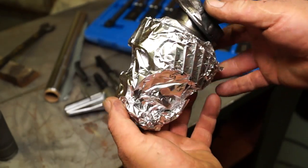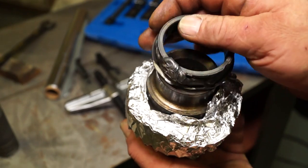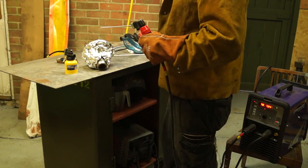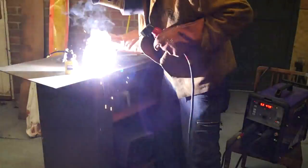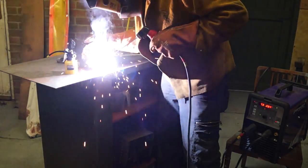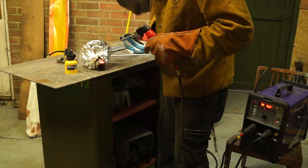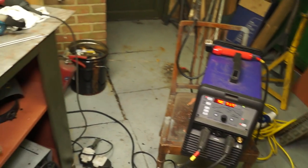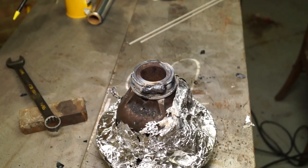If we're going to do any welding, obviously we want to make sure we don't damage the gears or any of the mating faces, so we use tinfoil — keep changing it if you're doing a lot of welding. Keep the amperage very, very low. I'm using 2.5mm rods at something like 70 amps, and I'm not putting too much heat in it. I'll put a couple of runs in it, let it cool down, then do it again. Basically you've got to weld evenly so you don't distort at all. You can see the welder running on 70 amps there.